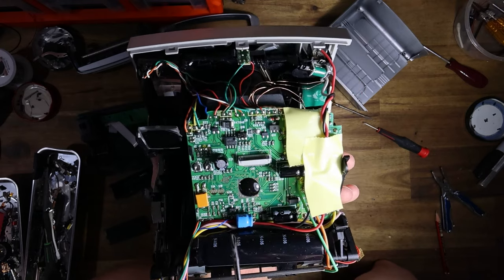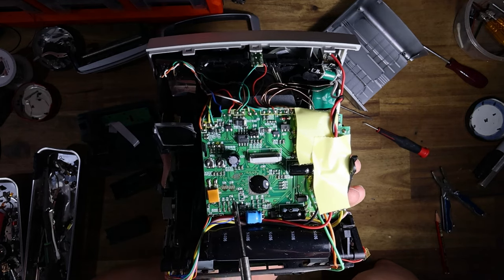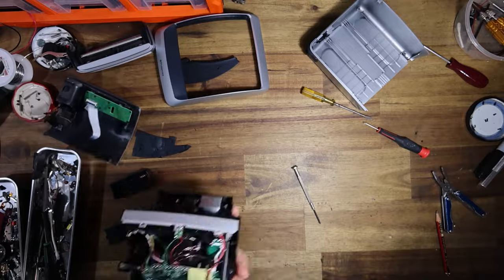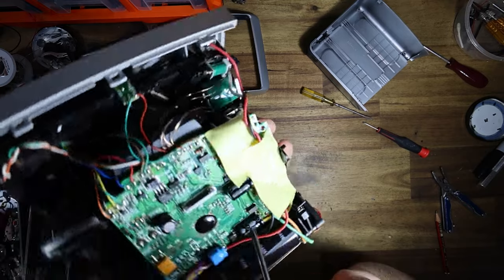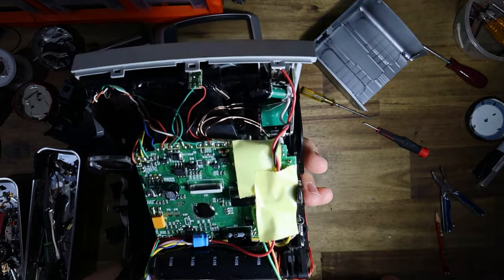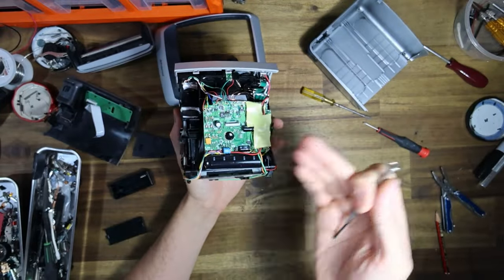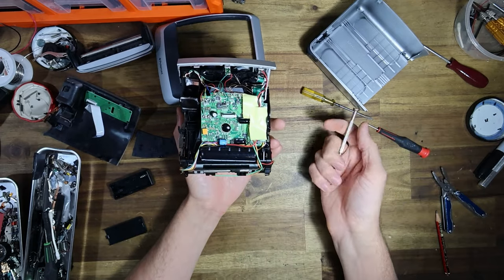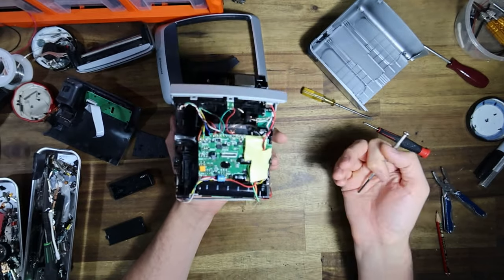What these switches do, I have no idea. It's S1A, S1B, and these seem like the kind of pads on the PCB that one of those rubber dome buttons would press a little carbon contact onto in order to bridge them. I haven't been able to find a service manual for them. But it could be that one of the things these cameras don't have is over or under exposure, and I wonder if that's what some of these switches are. I just have absolutely no idea. It doesn't say anywhere what they could possibly do.